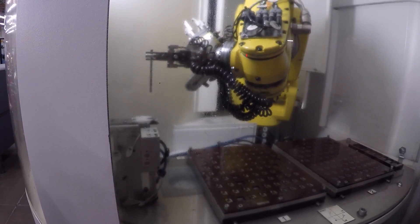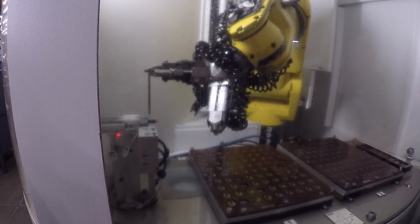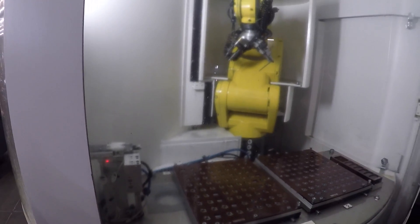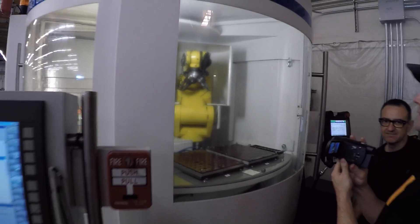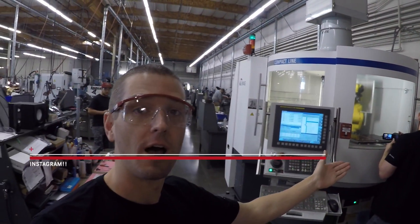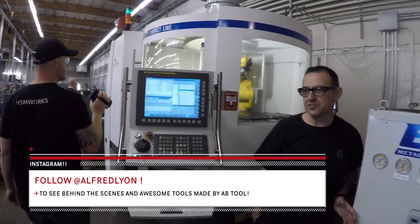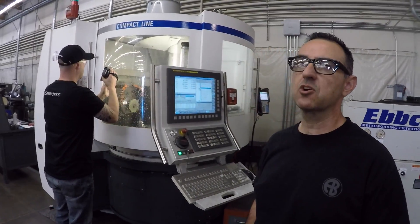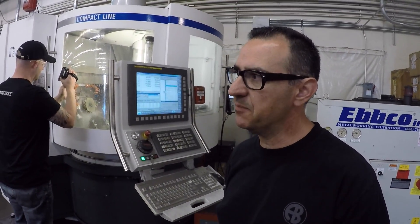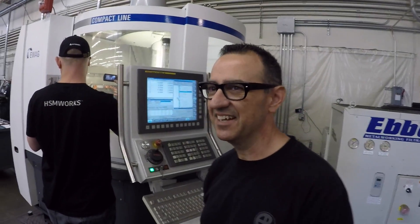The robot puts the pin back in the blank so it's ready to go. It's just kind of holding it — pushing on top as well. If you guys don't follow Al on Instagram, he posts a lot of really cool stuff — link in the description. And the coolant is chilled and filtered. Chilled because carbide can't heat up — it causes cobalt leaching. The same thing would happen if you put a solid carbide tool in a heat shrink and immediately put coolant on it — it would just crack. Carbide can get really, really hot and be fine, but if you spit on it, it's garbage. It can't take any moisture.